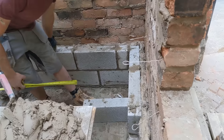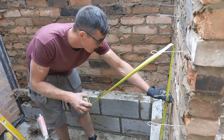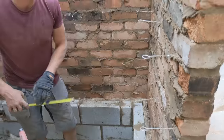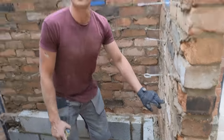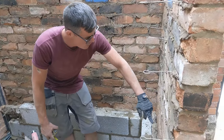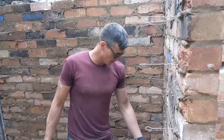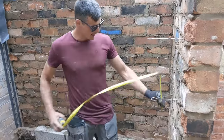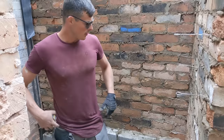It turns out we've got about a 50mm cavity on this side and about 50mm there, so I'm just about able to split half a bit of insulation and get it in, and then we're going to batten and insulate the internal walls. Earlier I mentioned measuring your ties out — you can see these ties here all the way along work with blocks and insulation, and measuring them comes to just about 440, which is close enough to 450 for ties. You don't want them too high because if you've got to bend ties down, moisture can easily come from brickwork into blockwork. If you do have to bend ties, bend them slightly up. All these are going to work perfectly.